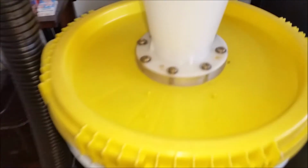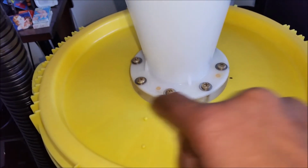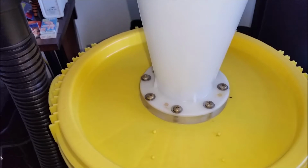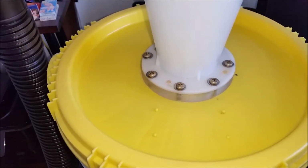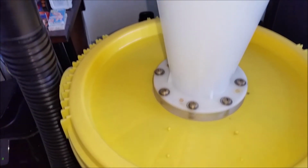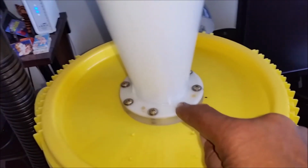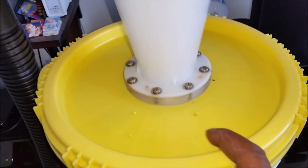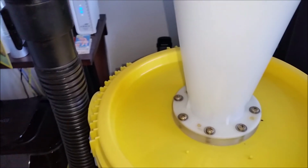So I went ahead and sealed both sides and ran this over the screw holes so I could also get some sealant in there. If I have to take those screws out, it's very hard to remove sealant if you coat the shank or the thread. So hopefully I'm not going to have any leaks in there. I don't think I will, but I ran all the screws in, tightened them up. This flange flattened out. Originally it seemed kind of wavy, but it flattened out and pulled the sealant out. And I actually had to clean the sides up.